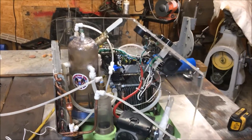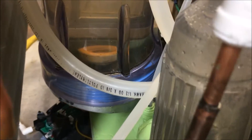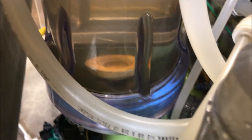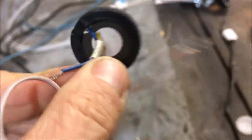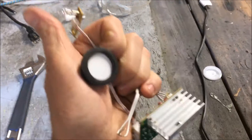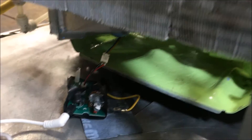What's going on fellas, today we're going to take a look at a little feature that I talked about during the construction of this hydrogen torch — my ultrasonic transducer. Basically what's inside is one of these little piezoelectric transducers hooked up to an ultrasonic driver. These come out of the humidifiers you see in a house. Unfortunately the only one I have that works is about seven watts, which is miserable.